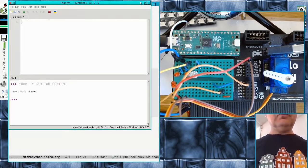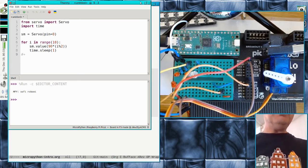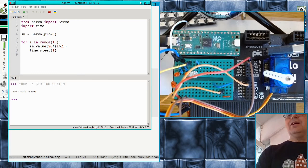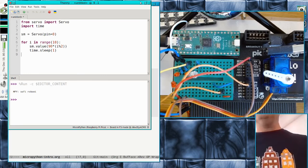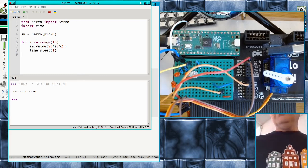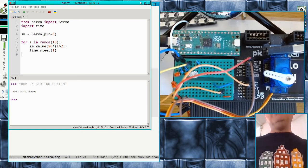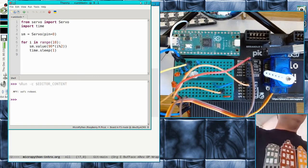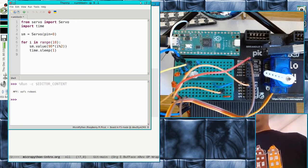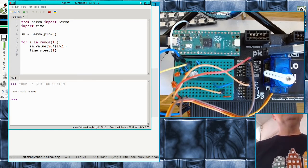Does it have output current strong enough to drive the motor? The strength depends on lots of things, whether the card is driven by micro USB or USB Type C, and this card is using micro USB, and there are obviously current limits, so you have to check whether you have enough power. But obviously you can use transistors and relays and whatever you need, you can turn on the power plant if you have enough steps in the middle. So as long as you have the binary signal, you can always amplify it and do whatever you want with it. Probably should be in the specs of the card.